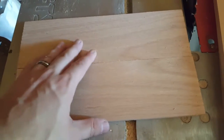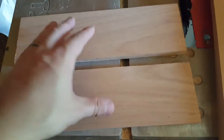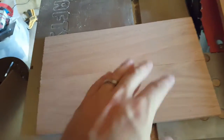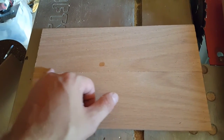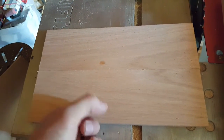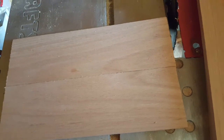So you have to buy another two-foot or four-foot board. The other issue is typically with these hobby boards, they don't come high enough. I needed seven inches high, which would typically be like a one-by-eight — nominal about seven and a half to seven and a quarter depending on where you go. And they don't make that typically in half-inch sizes. If you have a planer you can plane it down, but I don't. So what we're going to do is actually glue these together. We're going to take some wood glue and clamp them together to make one big baffle. It saves a lot of money — the oak for two four-foot sections is like $15 or $16, and $5 for the MDF, so like $20 to make the baffle.